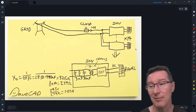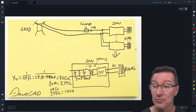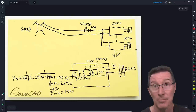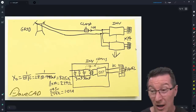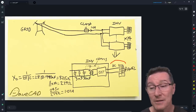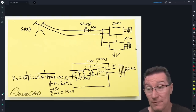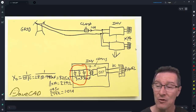Let's have a look at the block diagram. I don't know the exact circuit inside the Enphase micro-inverter, but this has been confirmed by Enphase: the output filter capacitors are three 330 nanofarad capacitors. These micro-inverters are all potted so I can't do a teardown. And then of course it's got some switching transformer-type circuitry. Interestingly, all the active circuitry is actually powered from the DC side coming from the panel. So at night, when the light vanishes, there's no more power for the internal circuitry — all you're left with is essentially the filter capacitors.